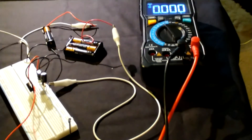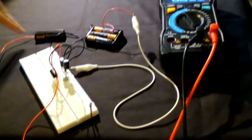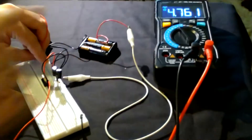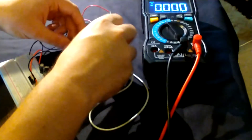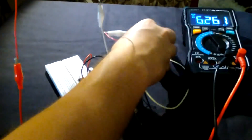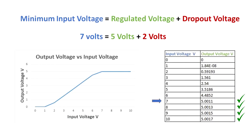Let me take out one battery. Now I only have two batteries connected in series — let's see if it works. It didn't get to the regulated voltage; it's lower. Although we get close to the optimal potential difference, it is not enough. I measure this combination and we get 6.2 volts across these batteries. These two batteries provide 6.2 volts — it's not 7 volts. From simulations, 7 volts is the minimum input required to get the regulated output. Any input below 7 volts will give a lower output voltage.